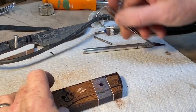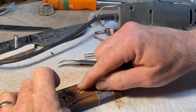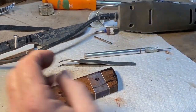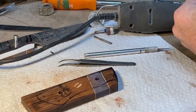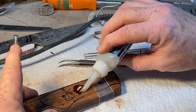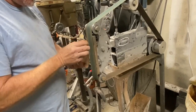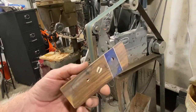This wood was stabilized before I segmented it. I then used some thin super glue — the Bob Smith brand, which has always worked really well for me — and I saturate the dust with that. It penetrates all the way down to the bottom, securing the ivory into place and filling those voids with the dust. Then I go back to the 2x72 grinder and sand the top of those scales so that the ivory is flush with the top of the scales.